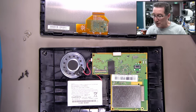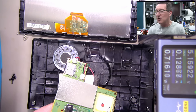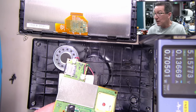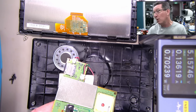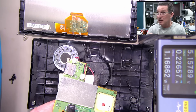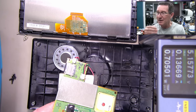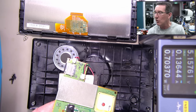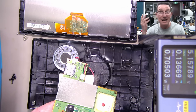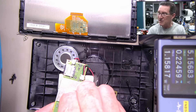Let me plug it in and show you what it's actually doing. I've left it plugged in for quite some time and it just does not charge. But it's pulling something — as you can see, it's like 1.1 watts, 0.7, then down to 0.13, 0.2. It seems like it's periodically jumping up as if the charging is starting, going into charging mode and then backing off. I've left it there for a day and it doesn't seem to do anything. So that battery might have come a gutter, but something is happening there.